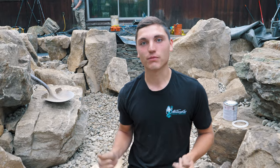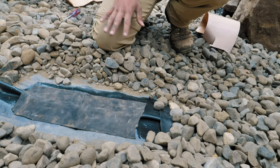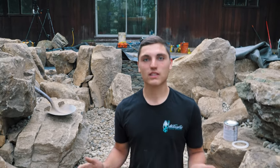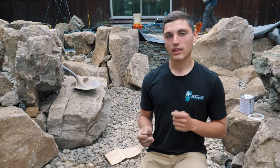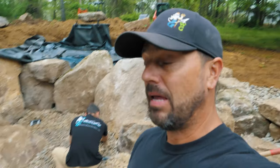Here's a pro tip we're working on. Sometimes when we're putting our liner in, after placing a lot of rocks on it, it can create folds at the bottom. Those folds can pinch up, and when you put your gravel in, it could actually pinch the liner and possibly put a hole in it. So what we're doing here is cleaning off the area where we have one of our big folds, laying down some primer — you've got to wait for it to get real tacky so it sticks — and then putting pieces of cover tape over it. That's going to hold it down and not let gravel get in between and shift on it, possibly causing a hole. Having folds stick up with gravel sandwiching them together can definitely be a problem area. If you're walking in the pond and pinch that spot, you could put a hole in it and not even know it. Taping that stuff down with seam tape is definitely important — you don't want any future issues. You just want to enjoy your pond.